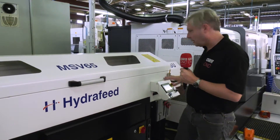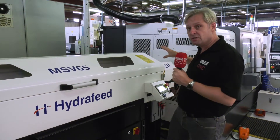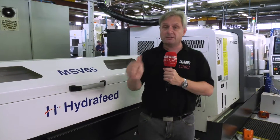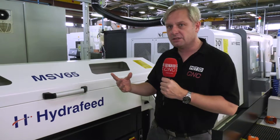To set it, you can put it into manual mode. Because it's a CNC bar loader, it works in conjunction with the machine. You can put it into manual mode to set it, but another reason you might want manual mode is if the machine behind us needs chucking work done on it. Nice and simple. Mention the guide bushes - really easy to change those over.